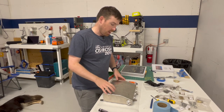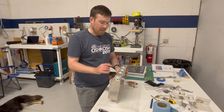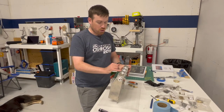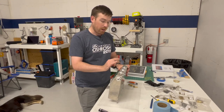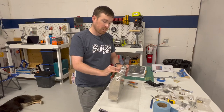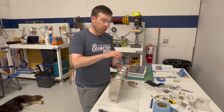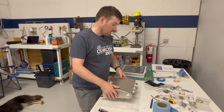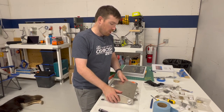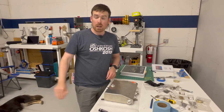In reality I really torqued hard on them, so we took them out and inspected the threads. Sure enough, the first couple of threads on the two I did first are a little bit mushed. I've ordered a tap and I'm going to re-tap those, and re-tap all the rest of them as well to make sure all the fittings can get enough depth. While I'm waiting for those things to come in, I'm going to park this and move on to working on the autopilot servo install.